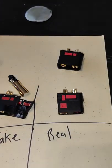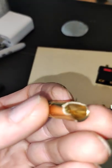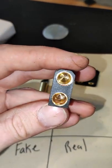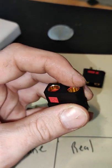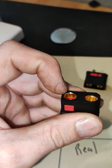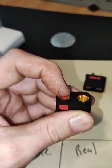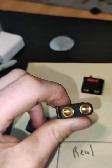Now the biggest thing, which has been mentioned — the red ring. This is the barrel out of the female side. If you look inside of this barrel, there is nothing in here; it's just straight brass. If you look inside the real one, you see that red ring right there. That is a very important ring. What happens is this pin connects when you plug it in. However, this first half of the ring has the resistor connection, so that resistor bleeds the spark away before it makes a full connection at the second part of the brass section. As you plug it in, it touches this first ring to start moving current, and then after that, when you plug it the rest of the way in, it won't do a big spark.